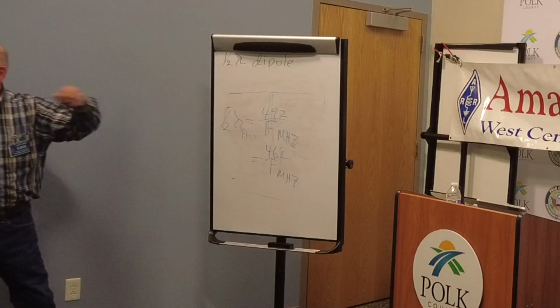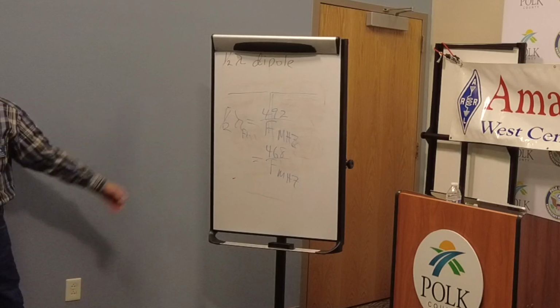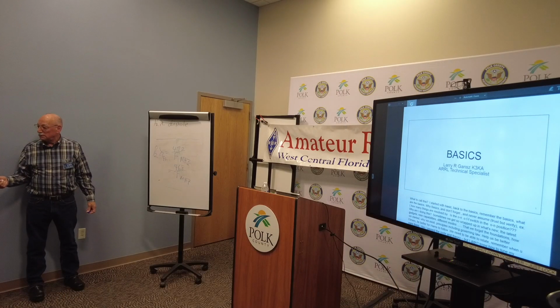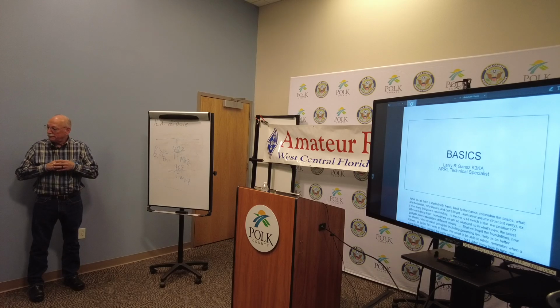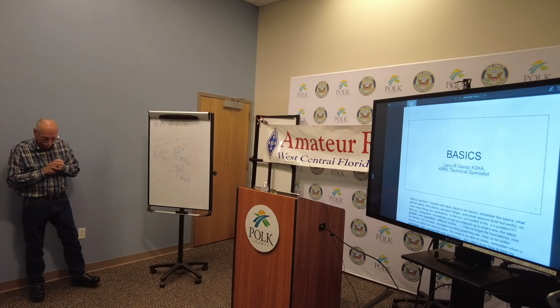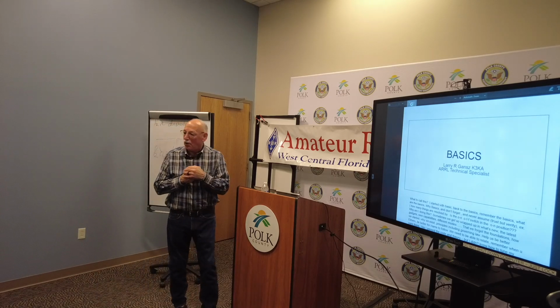Lower frequency, longer wavelength. Speaking of long wires, you hear a lot of people talk about long wire antenna. What is a long wire antenna? Not cut to a specific frequency, or it's cut to a specific frequency that is outside the amateur radio bands for our purposes. How do we know if it's a long wire?